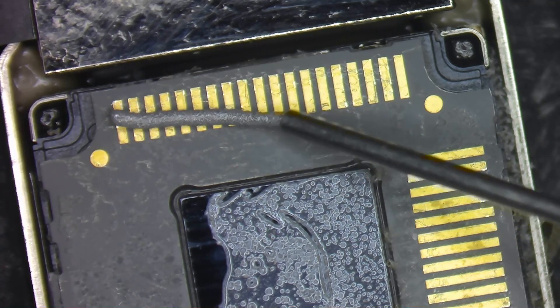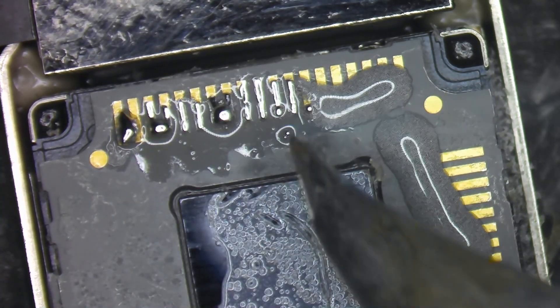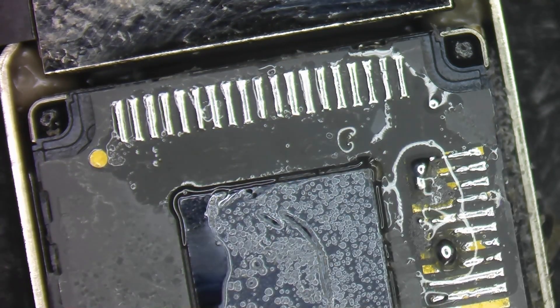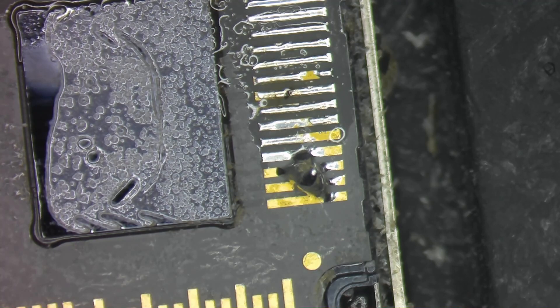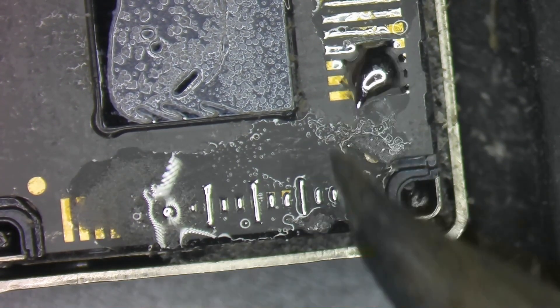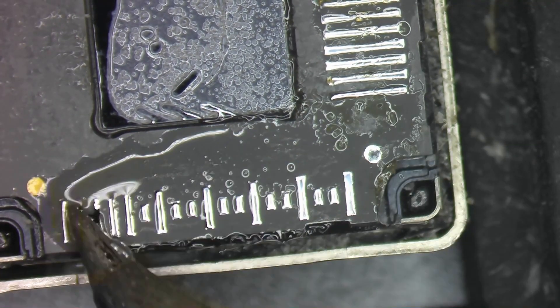This is 183 solder paste. I'll take my soldering iron and carefully spread out all the solder to have uniformity across all of the pads. You can kind of see where it's not wanting to stick — there might be a little bit of adhesive residue there. These bigger pads are a little harder to solder to.